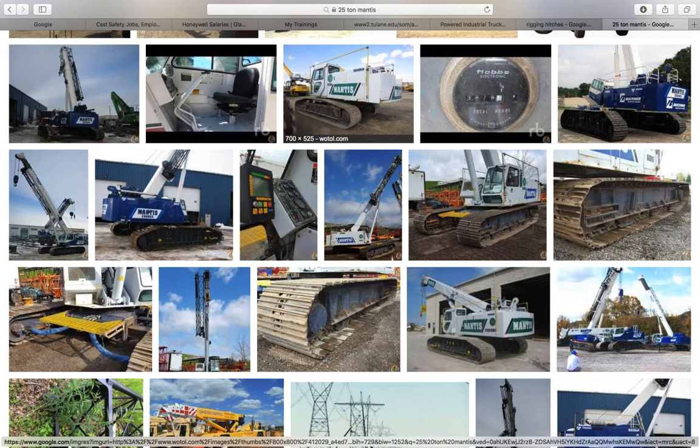And my position was this. My first question to them was, how much did the pipe weigh? And how do you like this? The operator and the project manager couldn't tell me what the pipe weighed. So of course, the first thing I want to know is what schedule it was. It was schedule 80 pipe, and I knew the diameter was 12 inch because it was a mixing line for an above ground storage tank. Then I called the plumber and the plumber said, hey, it's between 80 and 100 pounds.